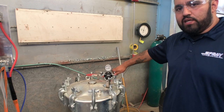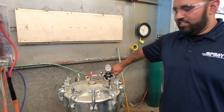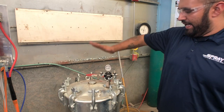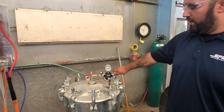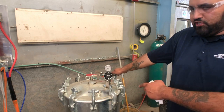Once you've conducted the bleed procedure once, it's recommended that you do it a total of three times — 10 to 15 seconds each. You can wait about a minute in between each one. That way you know that the nitrogen blanket actually settles on the material itself. Not fully open, but enough to get the air out of the pressure tank.